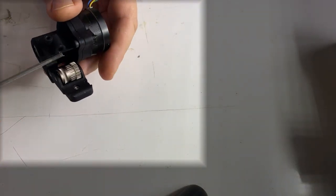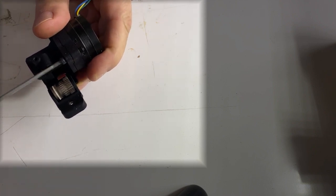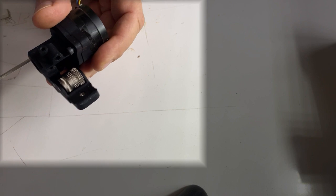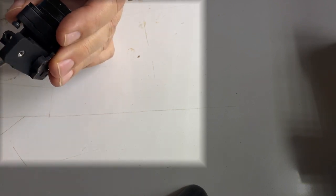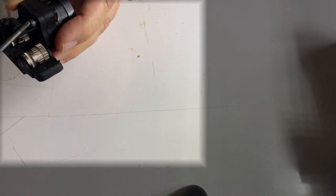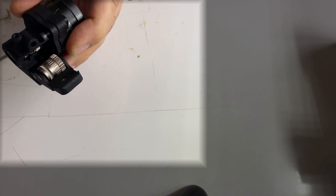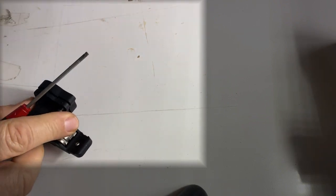This is the Vividino Direct Drive Extruder, which is easy to check up — and you should check it for some possible quality issues. We have the drive gears, which are cloned from the famous Bondtech extruder. The use of clones is to be expected for the price. The cloned drive gears are definitely not bad, but not as good as the original. It is suggested to upgrade them to the original drive gears if you are planning to print TPU.